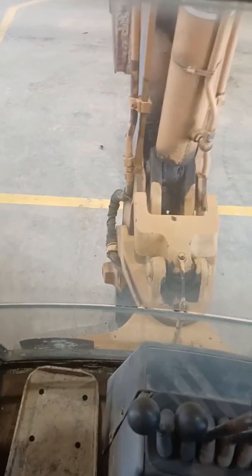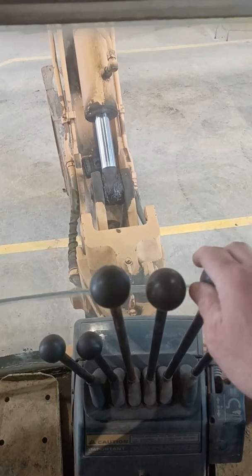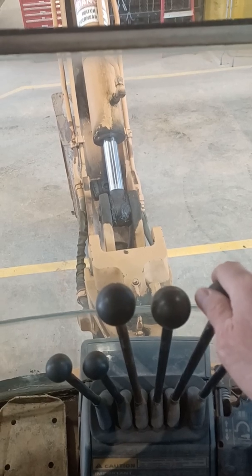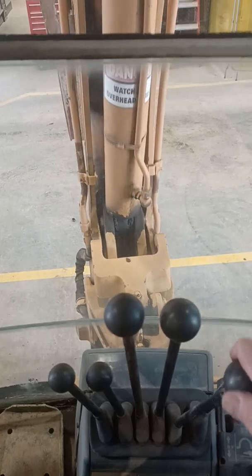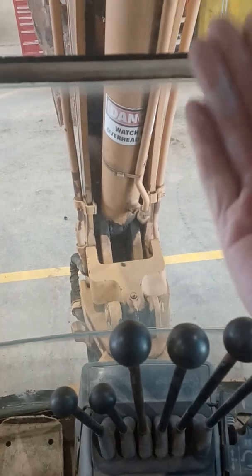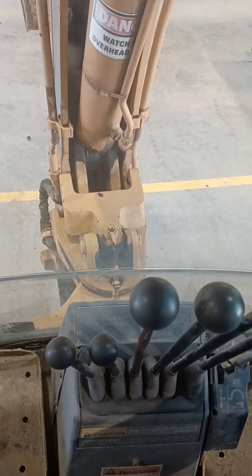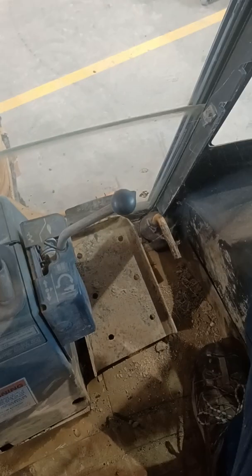What you need to do is anticipate that wag. Right now I'm not in the lock position — I've got to bring it up, and once I get that wag started, I've got to go the opposite way on the lever. Watch carefully. Sometimes we have to bring the engine RPM up a little bit. That took me two tries, but once it wagged over center — it's generally a little easier to do with the engine just off idle — I've got it in the transport lock position; the lock lever has latched.